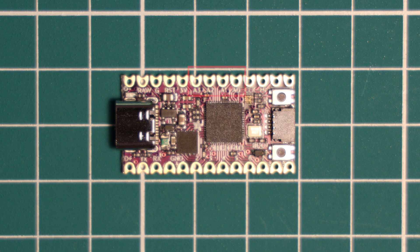There are four analog pins and most of the remaining pins are standard configurable digital GPIO pins. There is a Stemma QT connector for connecting extra I2C devices and breakouts without soldering, and finally there are two differential USB pins — D+ and D− — for connecting to an external USB connector in a different location to the onboard USB-C. The pins are castellated and this is a single-sided board, making it very helpful if you want to solder this board directly onto a PCB, as you might do in a keyboard build.